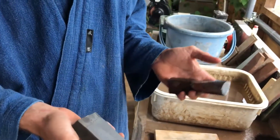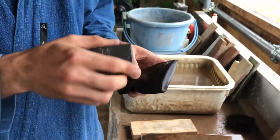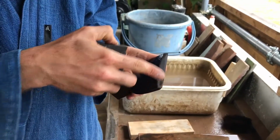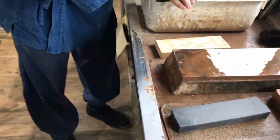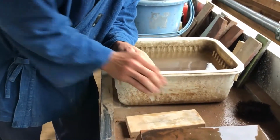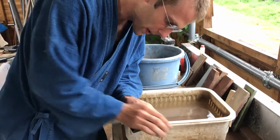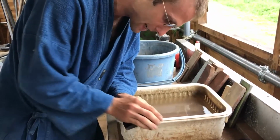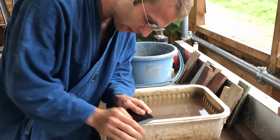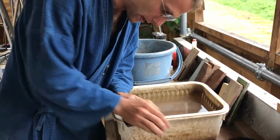And then once you get this part fixed up, the shape is about what you want it. What you want to do is start to get the grooves that the sharpening stone's making to go at 90 degrees to the edge, or fairly close to 90 degrees. Of course it's curved, so they won't all be 90. But even a little bit of a diagonal is okay, but you want to get it closer to 90, okay? Because what we've seen in a lot of studies is that when it's sharpened closer to 90, it cuts better. You get fewer large cracks at the edge of the blade, even with a plane or whatever, than you do when you're sharpening it parallel to the blade. Okay?